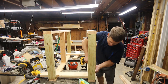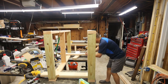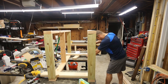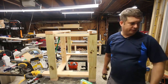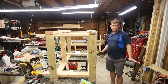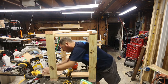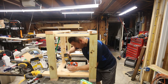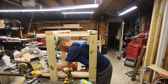I'm going to put one screw in here and square the second one, then screw the rest in. There's something worth seeing here: I've reversed how I'm attaching legs — I've attached them to the top because I know where the top is going to land, but the bottom may not be set right. That's where my block comes in. I can line that up and push it ever so slightly to get it in the right spacing. All my boards are the same length because they were cut on the miter saw.